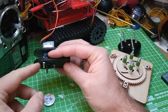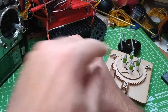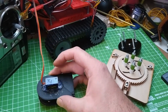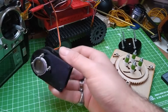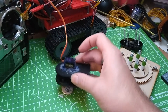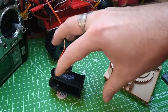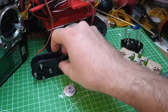I'd like to extend the jaws a bit, and I think it would be even better if there were some soft, squishy jaws attached over the top — these are hard 3D printed ones, but something quite spongy would make it a really good gripper. It can pick up quite fine objects. What's really nice is that because of the self-centering action of the jaws, it kind of gathers small objects into the center — very much like we'd do with our hands, drawing it together before picking it up.